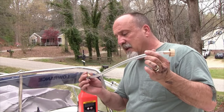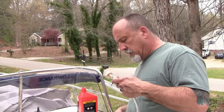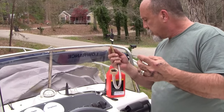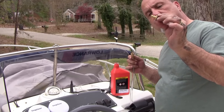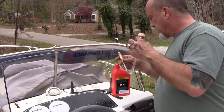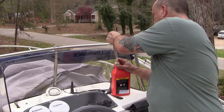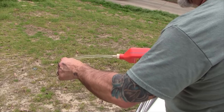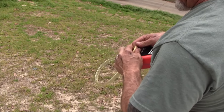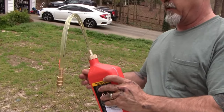Here's the second part — this is going to be the fill hose that we're going to use to add fluid to the helm. There are two parts to this: the hose itself, which attaches to the hydraulic fluid, and the piece that attaches to the helm — a 9/16, not a half inch like I said earlier. What I'm going to do is purge some of the air out of the hose to start with, just making sure there's some fluid in the hose. I'll pop this piece off to stop any more fluid from coming out. We've got most of the hose filled with fluid. I'll put a little bit of fluid on the helm fitting already, just so we get a good seal, and tighten that in there.